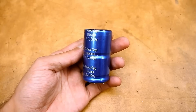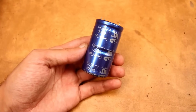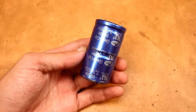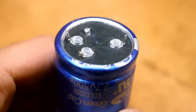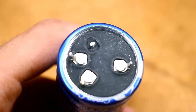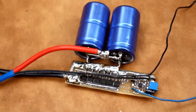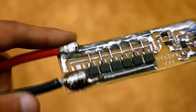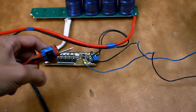My samples in particular can easily be discharged with currents of tens of amperes — actually I was mistaken, the maximum discharge current for this ionister is over 200A. Connect a couple of ionisters in parallel and there you have 400A. Three ionisters give you 600A, and so on. Let's try welding with ionisters. Our setup is a timer with a power switch — press the button, and the current from the ionisters goes through the field effect switches to the welding point.